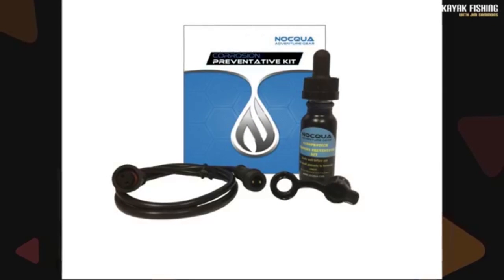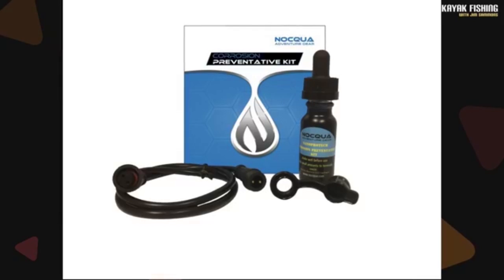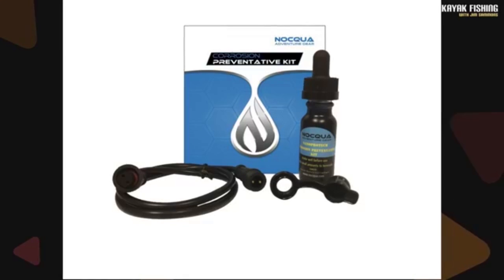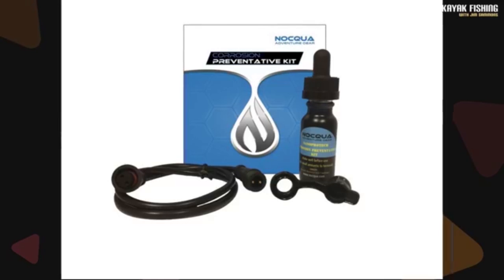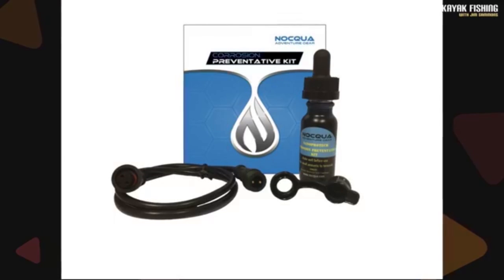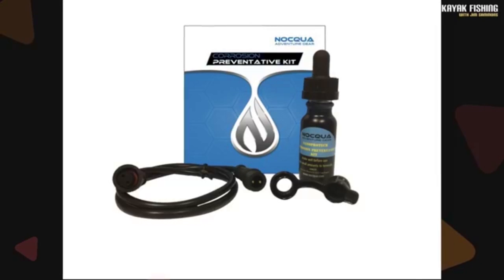If you are in saltwater for a huge amount of time, here's a picture of the kit. The other two items in it: one is a protective cap that sits over the top of your sacrificial connector, and another is a half-ounce dropper bottle of a nano pro anti-corrosion spray. It's a super cool product — a nano particle product where it actually gets into the really small grooves of the metal on a nano particle level. We found these guys when Billy was at a trade show in Las Vegas, where they were using an electric drill in a small fish tank — a really visual way to show it works. Just as a kit, those three items are going to be the best option to protect and preserve your battery terminals.